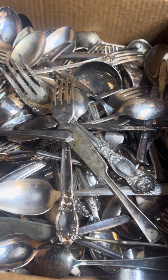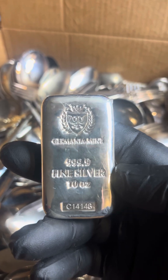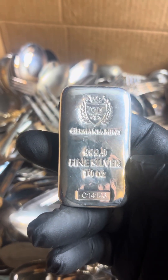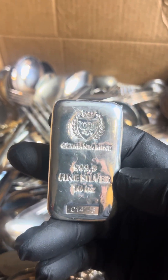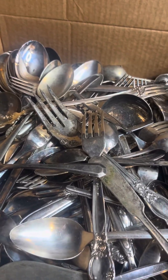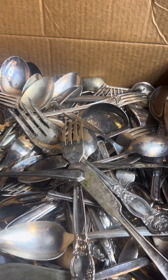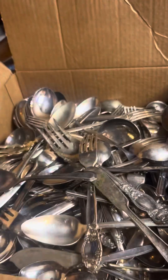If we're going to make a bar, let's make a bar. Our goal is to make it cheaper than $310 — I need to look up the price, it might be a little more, so there may be a correction on that. We're going to do a little silver stacking. I'm going to use sulfuric acid and a little bit of nitric to remove the silver plating, and the plates I showed you earlier will be running through a water cell to recover that.